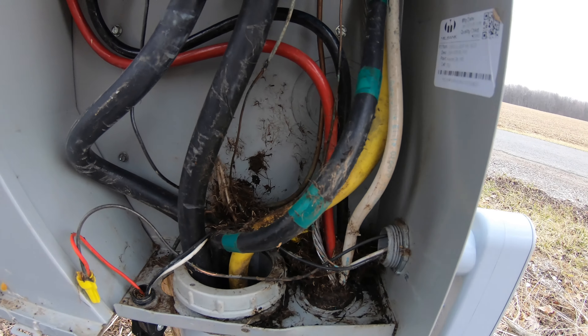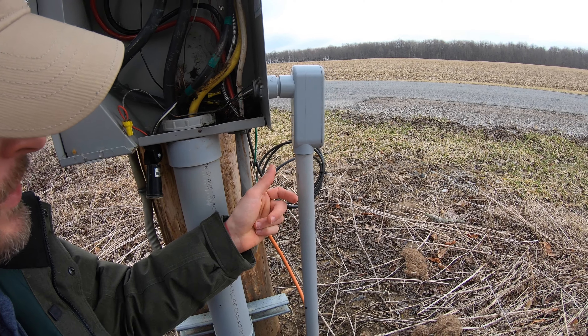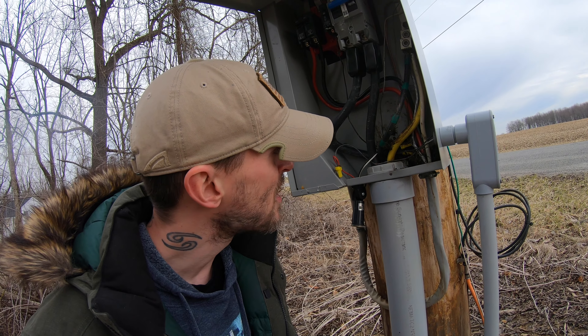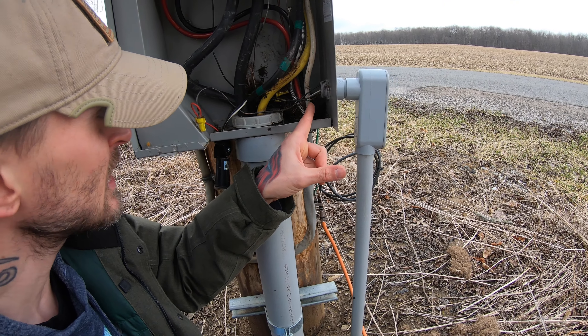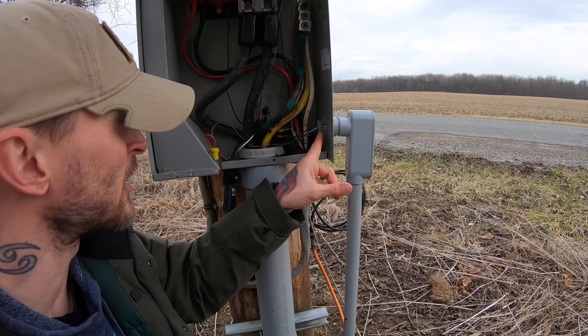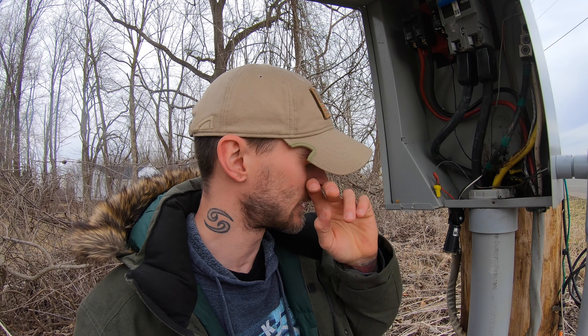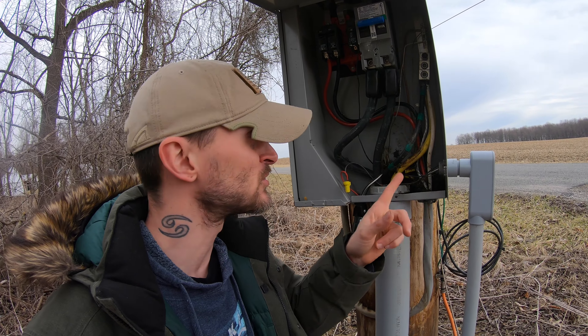This is actually a much bigger problem than I thought. See that black line right there? It's chewed through. This neutral line right there has no longer any white wire on it. The wires right here coming from here going over to the electrical for the gate and everything — the neutral, all of the white is gone off of that too. I don't know what I can do here except maybe cut the white and the black and delete all this back. Since there is enough wire right here coming out, maybe we'll still be able to put a wire nut on there and basically pigtail over. Since we're using a wire nut inside of a metal box, that should keep it approved — it's not exposed, we're basically extending a wire in a housing.